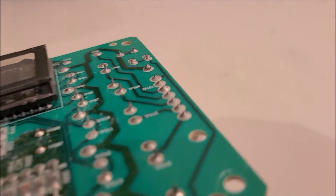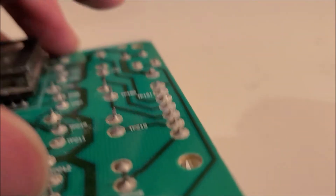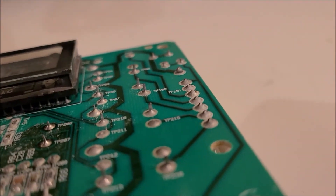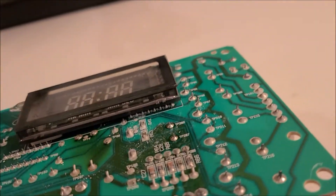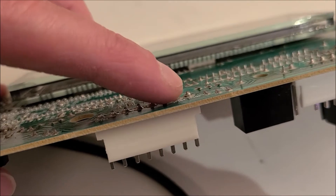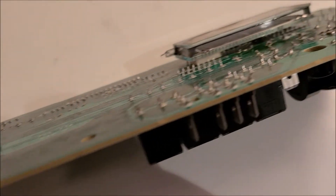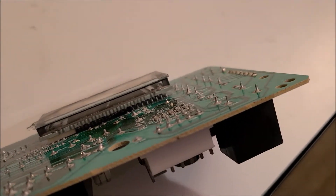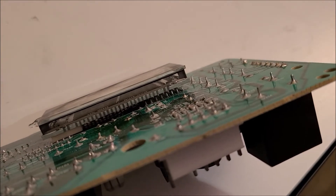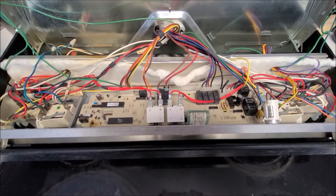After a little more inspection I found a broken solder joint from that pin right there, so I'm going to re-solder that pin as well. It looks like it's on the back of this power connector, which might also cause some issues. There are a couple other solder joints that don't look too solid, so I'm going to touch up a few places on the board that look like they might need to be re-soldered. Alright, we got our board back in place so we're ready to restore power and see if this makes it work.